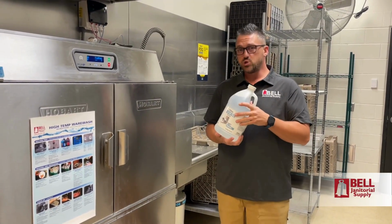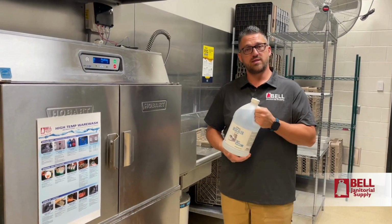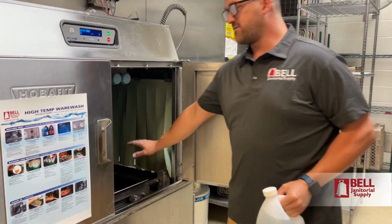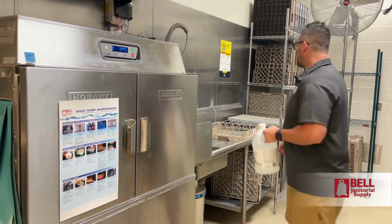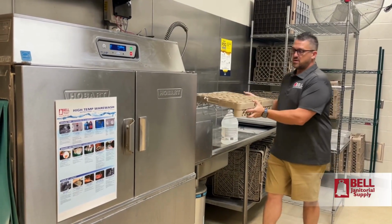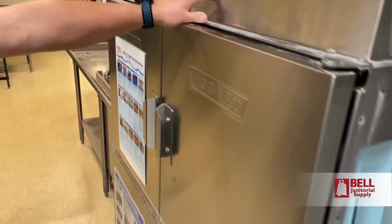We should only need about 2 cups of descaler about once a month. We're more than happy to come out and show you how that's done, but again, you pour your cup, open your door, dump it in the tank of water here. Once that's done, you can either run a deliming cycle, or you can get yourself a regular rack, put it upside down, and it will trigger the wash cycle without actually letting the rack go through.